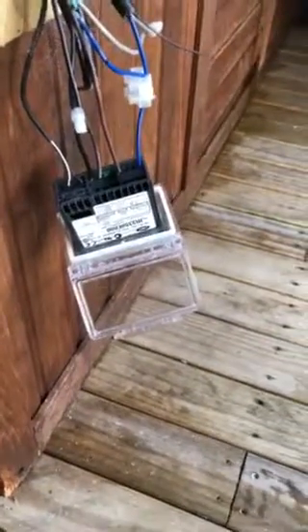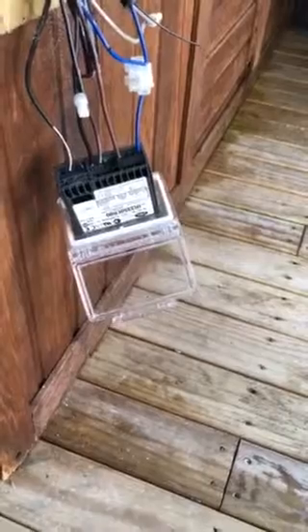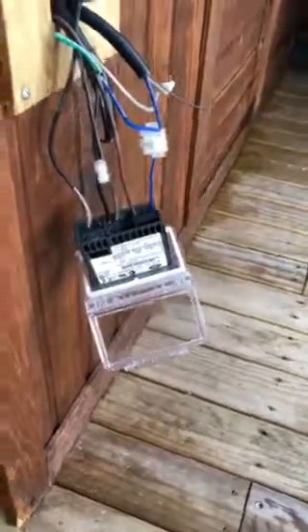And that's really it. Then you set your controller up to do whatever you want to do. Hopefully that makes sense - any questions, just let me know. Well, that's actually quite simple once I figured it out. They're not that complex, even though there are heaps of connection points going into it. It's really just positive, negative on the coil, and then positive in and where you want your output to go - constant positive in, and then output when it switches where you want it to go. In this case, feed my motor with the grey one on this side.